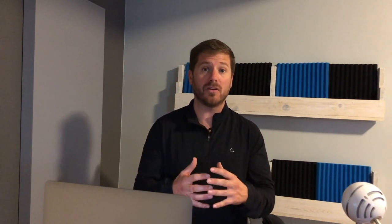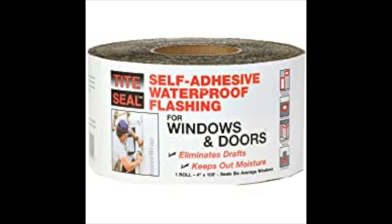Here are a few shopping tips for the right type of soundproof joist tape that you should buy for the project you're going to be doing. The first thing you want to look into is what the joist tape is made of. There are two different materials: one is butyl and the other is asphalt. Most people prefer butyl tape, especially for outdoor decks, because it has a wider temperature resistance and also it is a lot stickier. Asphalt joist tape is still perfectly fine, and companies like Deckwise and Cofer use precisely that.